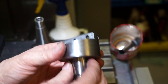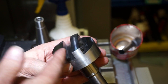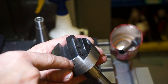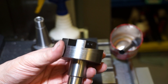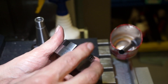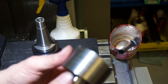I also checked the squareness by putting in a tool steel and measuring the difference in height between this position and the opposing position at 180 degrees. I had maybe one or two hundredths of a millimeter difference, which is actually extremely good considering the force put on this shaft when press fitting it. I realized that the shaft has to be perpendicular to the cross section of the groove where the tool sits, and the way I was clamping it, I think it's pure luck that I got it as square as I did. I actually think this is better than the first one I made.